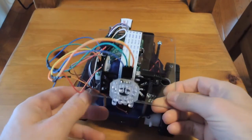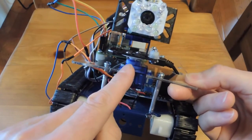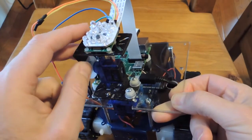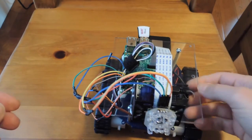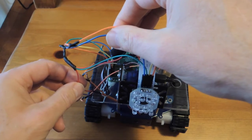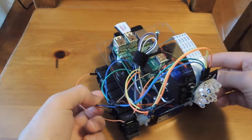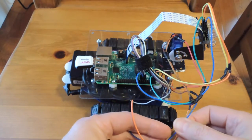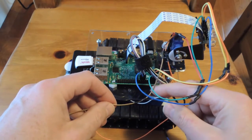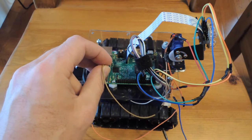Welcome back. I've done the three things mentioned. The pan-tilt is now mounted to the plexiglass with two bolts. I've connected the Raspberry Pi camera and Bright Pi to the top bracket with two bolts, and I've soldered the Y-connector for the five-volt power — the red cable from the bottom servo and the red cable from the top servo are both soldered in. That leaves three connections to make to the Raspberry Pi. The first goes to pin 34 for ground — I've previously soldered the two ground cable connections together so they come to one ground connection going into the Raspberry Pi pins.